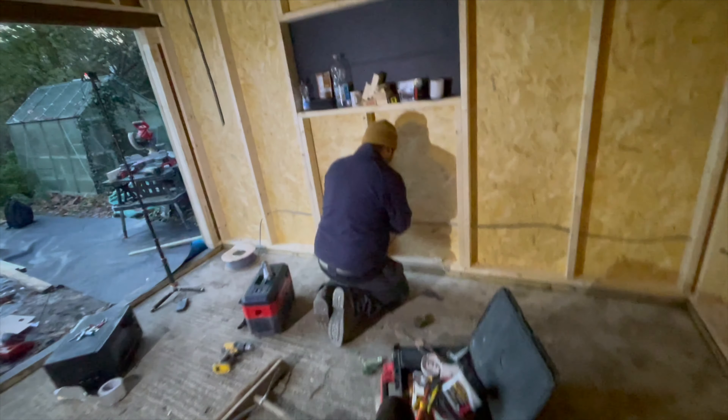Someone's carrying 18 sheets of plasterboard. That's the main room plasterboarded — two layers of plasterboard on the ceiling, one layer on the walls, and a layer of 18mm OSB just to give it a bit of rigidity.